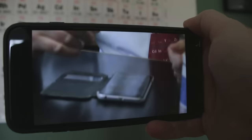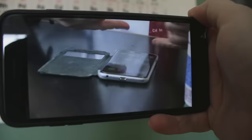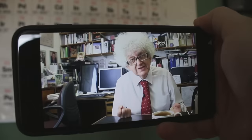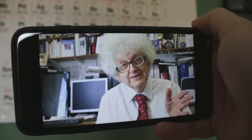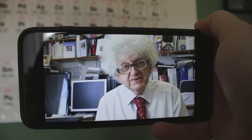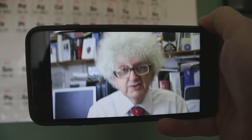Tin oxides are important in screens on smartphones and similar things, because the display consists of a material sandwiched between two electrodes, and obviously the electrode through which you're looking has to be transparent. Indium-tin oxide — a mixed oxide of indium and tin — is electrically conducting but transparent. So indium-tin oxide is a key component of most smartphones and other displays. If you're watching this, you're probably watching it through a thin film of indium-tin oxide.